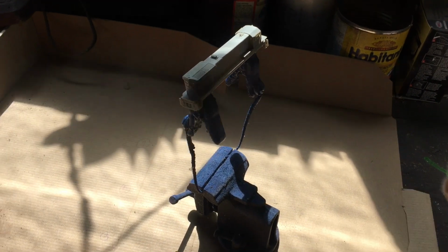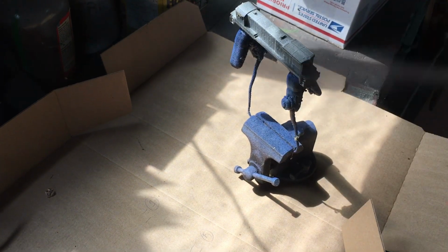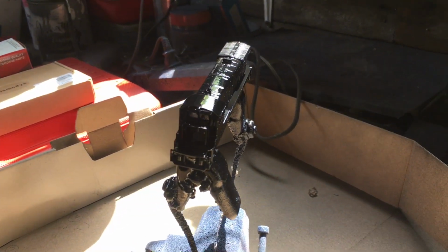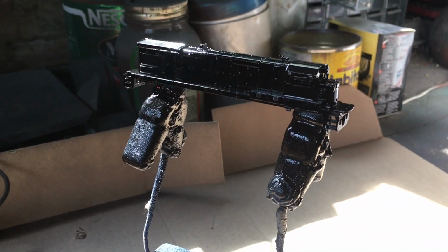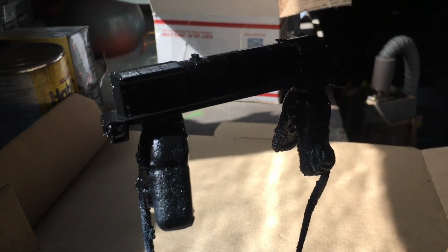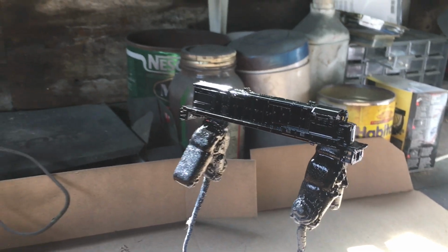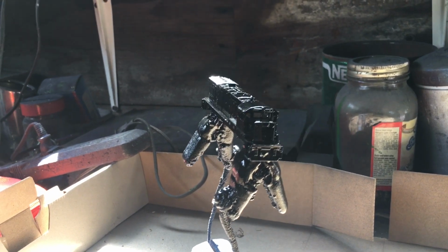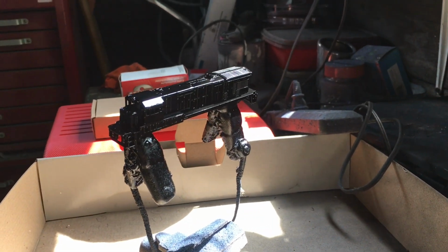So if I can, I will do just one very light coat. And that's how I work it. And I'll build everything up very slowly. So it looks like one coat is gonna be good. I'm happy with that. The secret is you don't touch it for a couple of days even. This is Tremclad. It's pretty good quality paint. But it takes a little bit of time to dry. But it's very rewarding to spend the extra time. That worked out great.